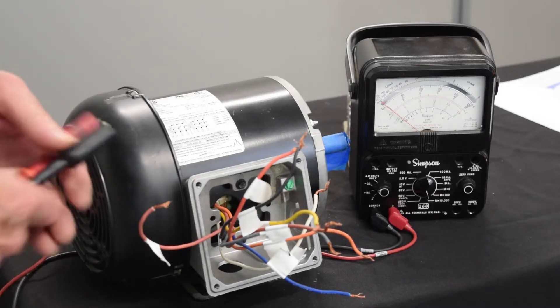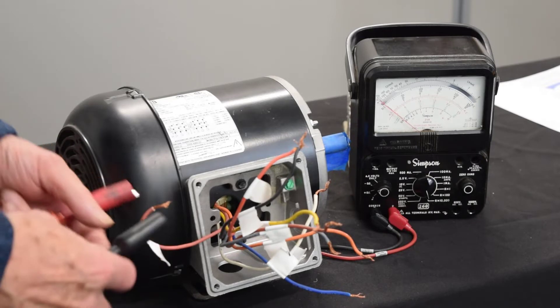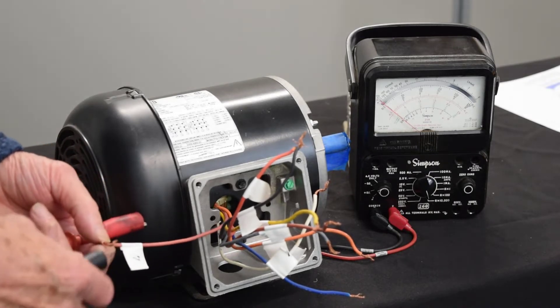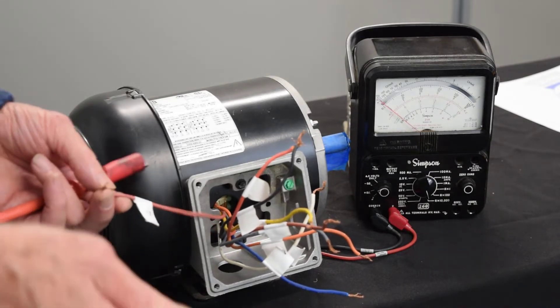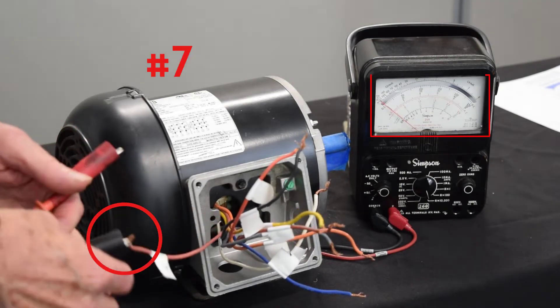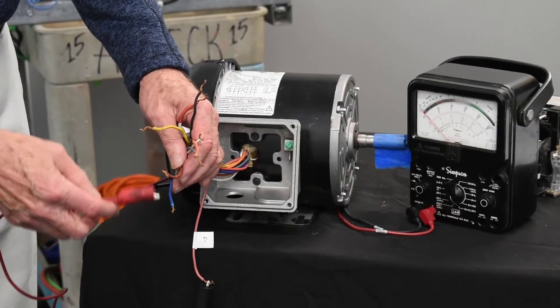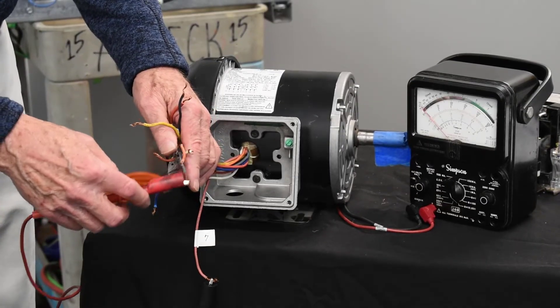In this segment, I'll do two things at one time. I'll locate my windings and then I'll touch the ground and see if I have a good high resistance to ground. I'm just going to randomly pick a winding — the easiest and fastest way to go through and find out which one is which.